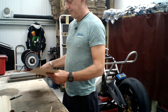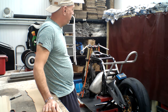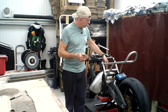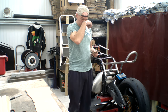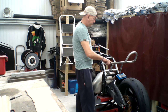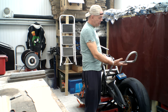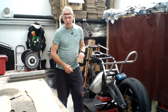Now, all good in theory, but once this is cut out of metal, it is going to be a nightmare getting it in there, because the sheet would have to bend past pieces like this in the frame and then come flat up against it again if I wanted this to be a seamless bottom. So what we're probably going to do is chomp that down into three sections and I'll fill each of these in separately. This is going to be the awkward one, but we can get around that, that'll be all right. So yeah, three bits up to there and that'll be it.